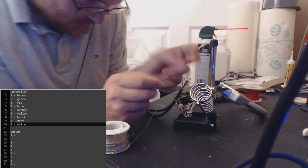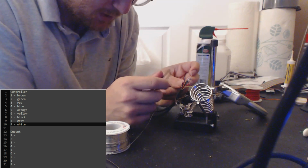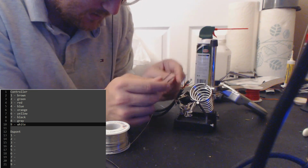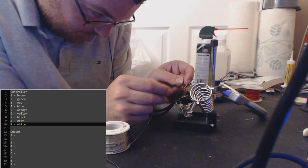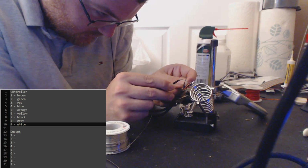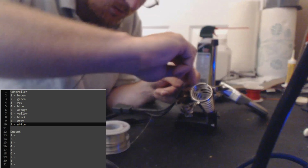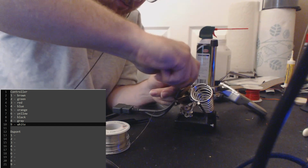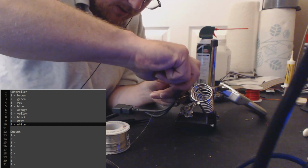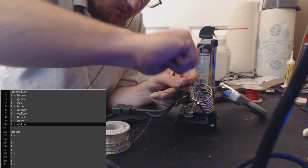But yeah, when you get controllers like SNES, NES, N64, GameCube, the fewer pins the controller has, the quicker and easier it is to do this, obviously. But unfortunately, the Saturn has 9 pins, which is the most of any common console. Or, excuse me, the PlayStation also has 9. TurboGrafx is DIN 8, I believe, and then everything else is 6 or below.